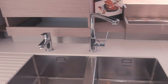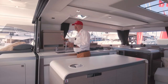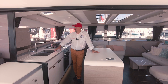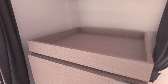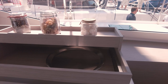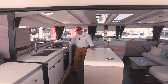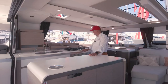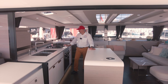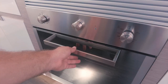We have a locker here, usually for the microwave. But if you're a healthy food lover, then this closet is completely appropriate. On top, there's still some space for bakery products. These things were inherited from previous yachts because they had proven themselves quite well and are convenient. These shelves are more developed and segmented. A good gas range — but many clients ask to change it to a combined gas induction stove, arguing for more independence and to not burn gas in the marina or emit excessive amounts of CO2. The gas oven here can be changed to electric. Above the cooking surface there's a very important hatch, which the shipyard now arranges on almost every boat.